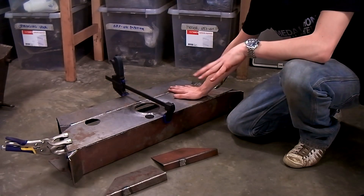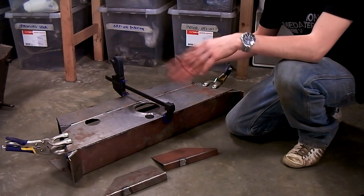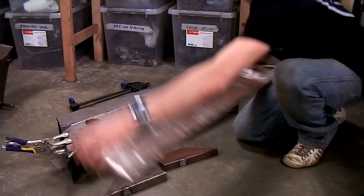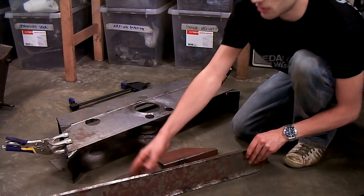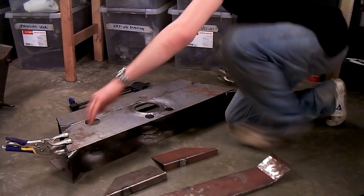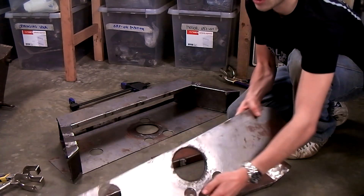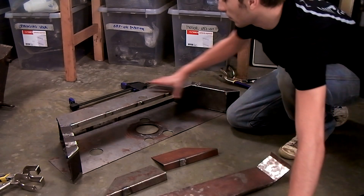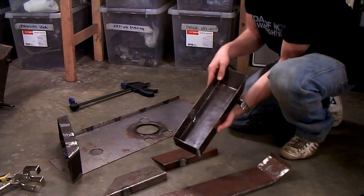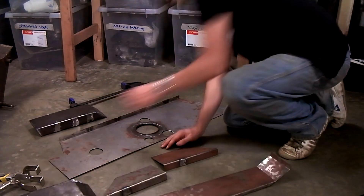This is the front T-section mock top. These are two of the strengthening plates that have to go inside. I'll quickly disassemble it and show you all the parts. This is the top piece — I made it from one section with folded edges just for rigidity. The front of the T-section is in two different pieces, and this is the welded-in ring from the original one. This one has two folded edges and is very rigid. These are both the side pieces that I folded up, welded, and then ground off. And this is the back piece.